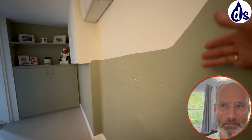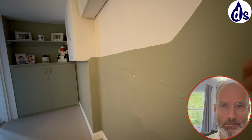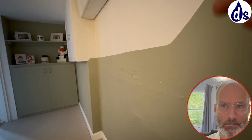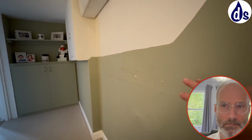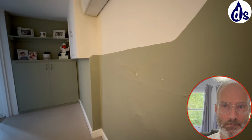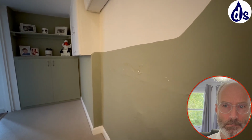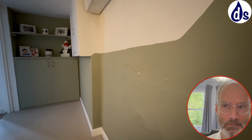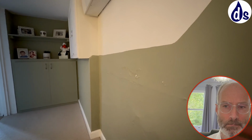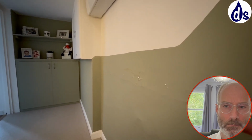So nothing has changed, but by putting plaster on it, you're reducing its ability to evaporate, so it's coming through in specific areas, and also you're noticing it more. So you could just ignore it, knowing that it's not going to cause any defects, though yes, there is a little bit more vapour coming into the air, but a lot less than drying a t-shirt, for instance. So it's relatively benign. But if for decorative reasons you wanted to do something about it, you could use a silver or foil backed lining paper and then paint over it, or wallpaper it, or whatever.